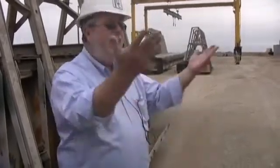The reason being, remember, that concrete is still green. You pick it up, it still has all of its own dead load held up by 4 lifting inserts, and you're actually stripping it away from the form. There's suction and everything else on there. That's the worst case scenario that these panels will see. Once they're up, they're in their ultimate design mode. That's the way they're supposed to be. When they're laying down, they're susceptible to cracking and everything else like that.